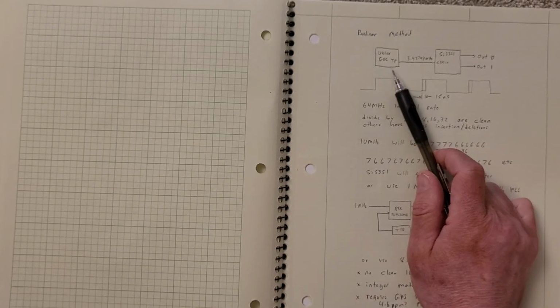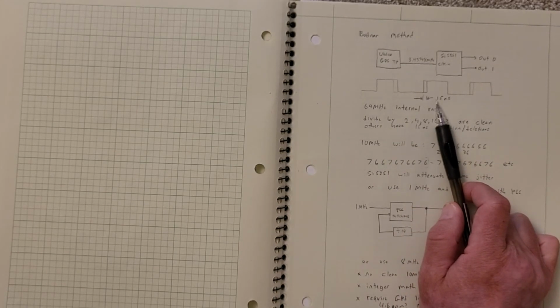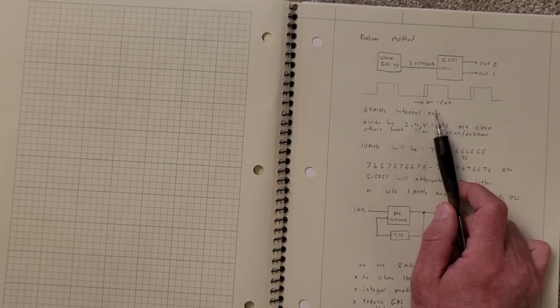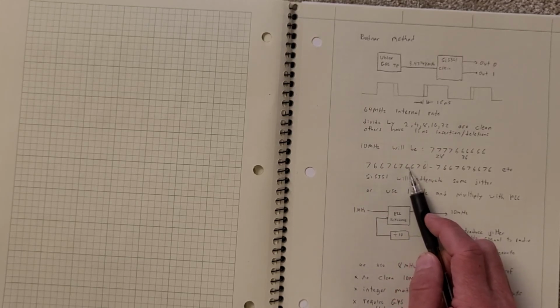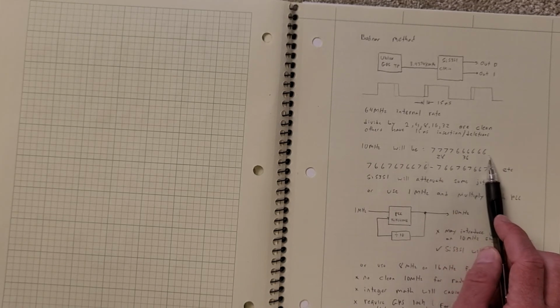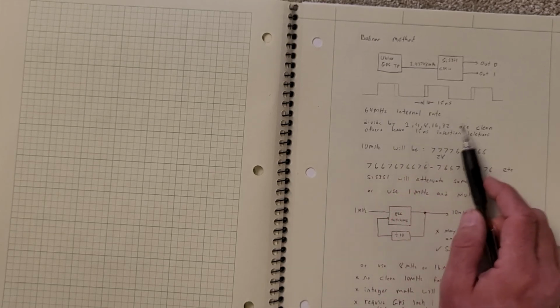So I like that. What happens is internally in the GPS unit, it has a 64 megahertz internal rate. And so it can place an edge every 15 nanoseconds, and that's what it does. So if you tell it to give me 1 megahertz, it counts 64 and makes your edge. If you want to do 10 megahertz, well, you can't, it doesn't divide evenly, so they have to do something tricky where they count 7, then 6, then 6, 7, 6, 7, 6, 6. They do this pattern, and this number of edges, 4 7-edges and 6 6-edges, gives you 64 edges total. So this pattern repeats, and that's why you see that jitter or that phase shift in the edges, because that's how they do the synthesis.